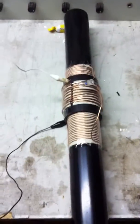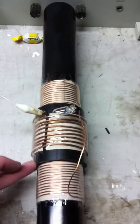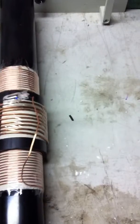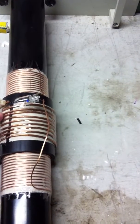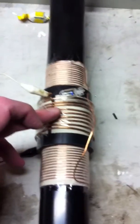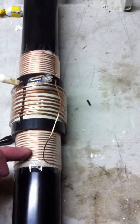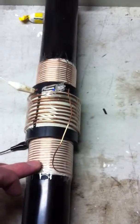Nothing is working yet, I'm just in the initial stages of getting it going. This is two pieces of PVC — I have a 2 inch diameter PVC here, and this smaller one is a 2 and 3 eighths outside diameter PVC. This is going to be my primary; this is 12 gauge bare copper wire, there's approximately 6 feet on this coil. This is my secondary — this is 25 feet of 18 gauge copper wire. I've just used double-sided tape and wound this on here in both cases and then covered it with clear tape to hold it in place.